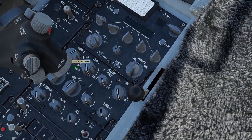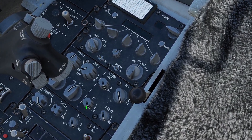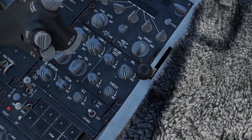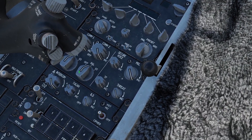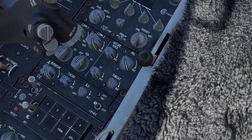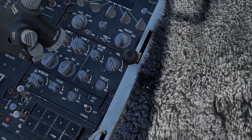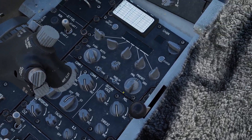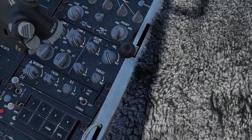First let's look at the control panel. These are the volume knobs for the UHF and VHF. If you bring them all the way down, it turns the radio off. This knob here controls the squelch. If you turn it off, you're going to hear a static noise, so I recommend leaving it in the squelch position. If you set it to GD, it tunes the radio to the guard receiver. For UHF, guard is 243, and for VHF, it's 121.5. I recommend setting it to the volume you want and leaving this switch in the squelch position.